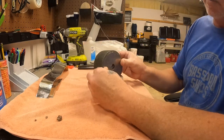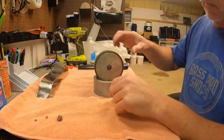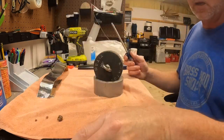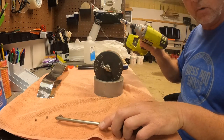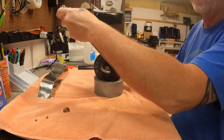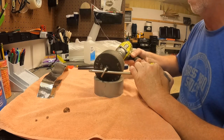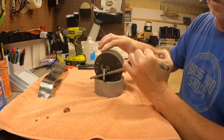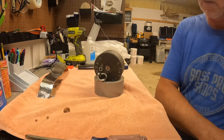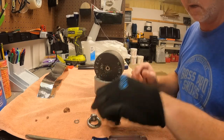This is my OG Titan — I've had it about two years, a little over two years now. The bolt head is a P3. You can either take a P3 screwdriver and another screwdriver to put in the eyelet, but I like to use an impact in reverse — it's a little easier to hold that way. Put the other screwdriver in the eyelet and the eyelet comes right off, maybe a little warm. I'll get some gloves and the bolt and eyelet is now out.